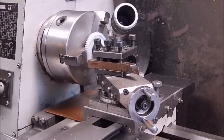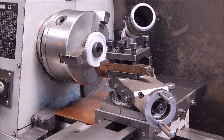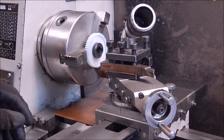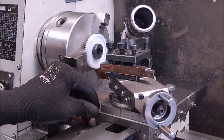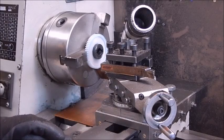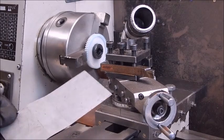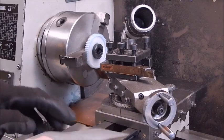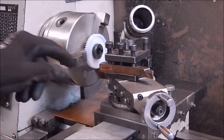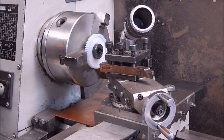We're ready to first machine the center boss back using a facing cutter. Here's a little trick I use all the time: when you're machining with the cross slide right across, the swarf comes off and falls down into the open section of the cross-slide screw. I have a piece of plastic bent to shape that slides in there, and you can wind the cross slide back and forth while it keeps the crap from going down the hole. Simple trick but it works great — saves a lot of cleaning.